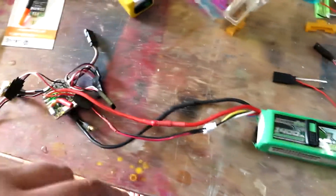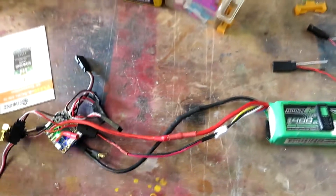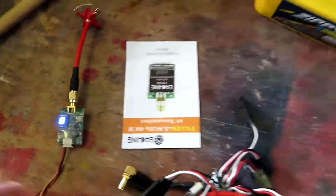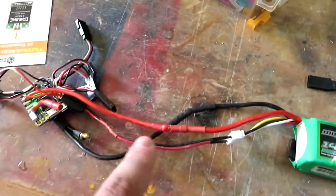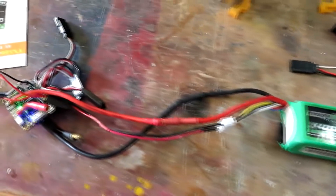Yesterday, because I was lazy and didn't want to get actual batteries, I was using these off-the-shelf power - a 3S with three-and-a-half mil connectors - and a separate battery for the balance plug because I needed 4S. Because I was using two separate batteries there was no common ground. Now I'm using the actual 4S battery I'll use in the plane, and you can see the FPV gear is getting power.